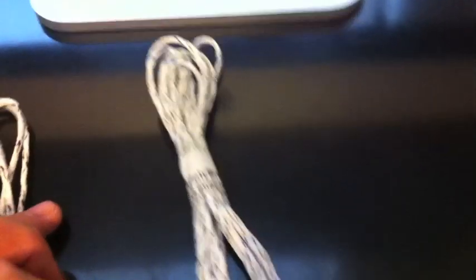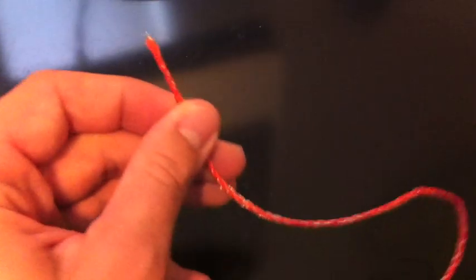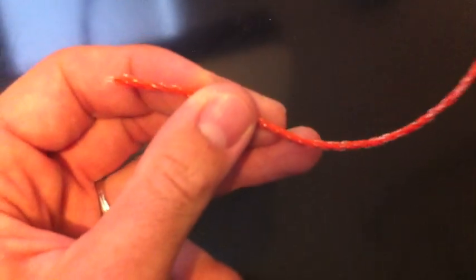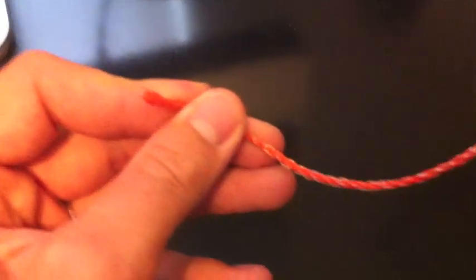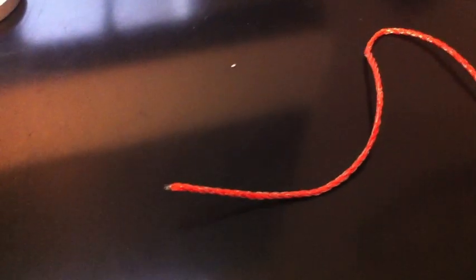The Polybraid, this is a product from PowerFlex Fence, okay? This I got at King Cove, and I'm not saying anything bad about King Cove, but there's a lot of manufacturers that make this Polywire. This stuff is just pretty flimsy, and over time it tends to deteriorate pretty badly. I've taken good care of my stuff, and I haven't used this in quite a while due to my internships, but I can speak from experience from other ranchers that have used this stuff. I've seen theirs, and the Polywire just basically falls apart. The poly breaks down, and all you have left is the wire, which makes it very dangerous to handle, and grounding issues, and all sorts of fun things that come along with that.